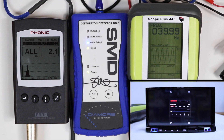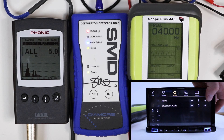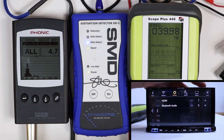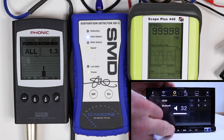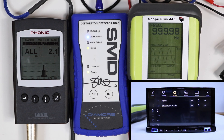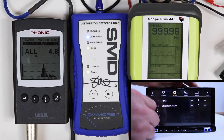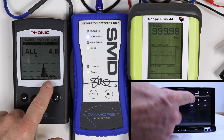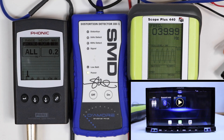Max volume: 2.1 volts. Let's start turning it up. Turn it back down to 7 — we're still getting a little distortion at 7. We're going to turn it down to 6 and we're going to get a 4.2 volt output. 1000 hertz HDMI preamp output. Max volume: 2.1 volt output. Clipping at 8, we still have distortion. So 6 it is at 4.3.